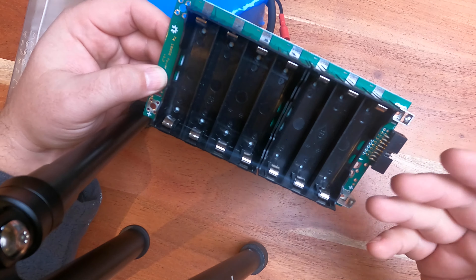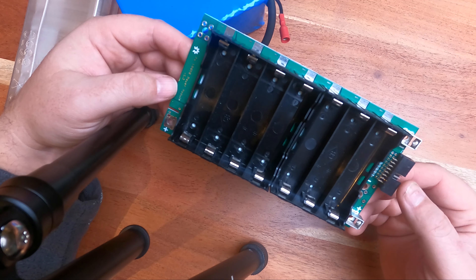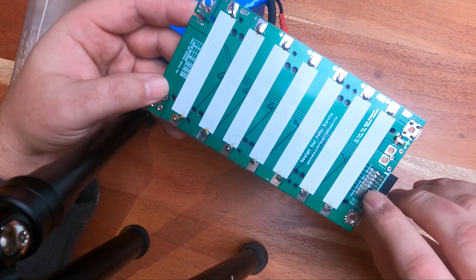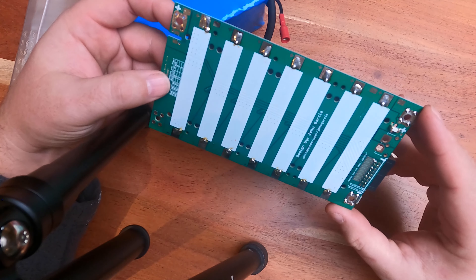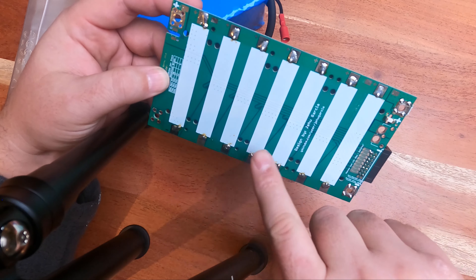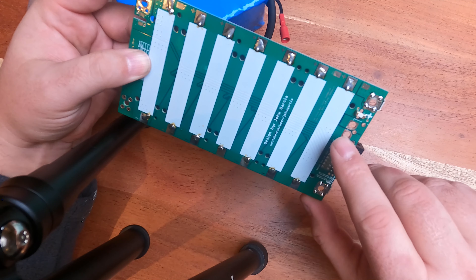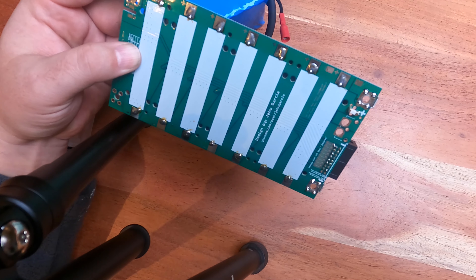Because it's a 7S, one battery is no longer being balanced through the balance lead, and indeed you can create an imbalance here. Because if that one keeps draining and your charger wants to bring this one up to 24 volts, but it's only having - in this case - not 7 but 6 cells, that will cause a problem. Because the other 6 cells are having a higher charge than your set 4.2 volts.